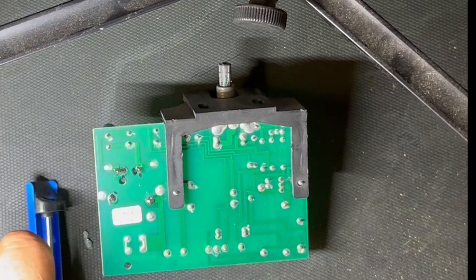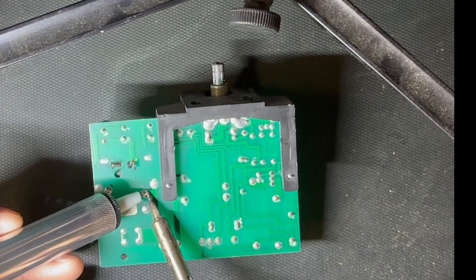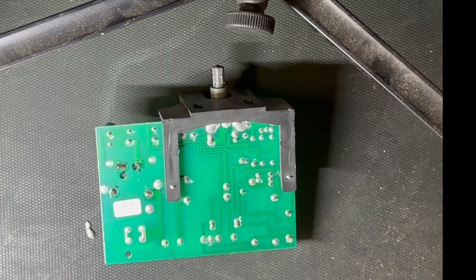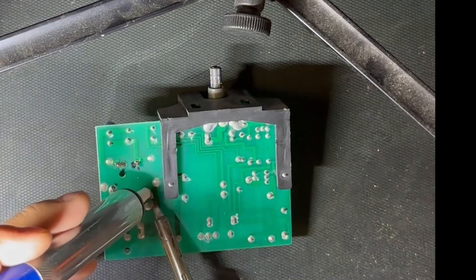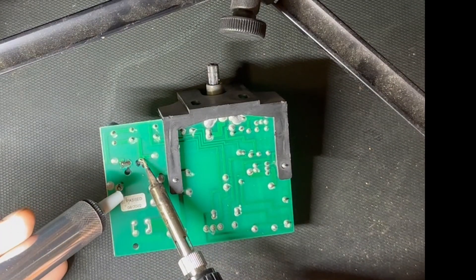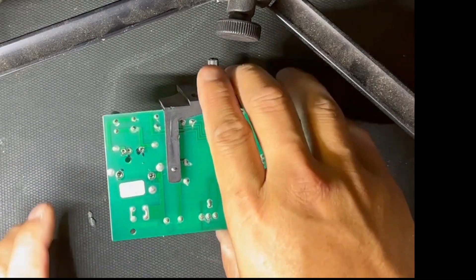I have the piece here. To remove the old relay I'm going to use the solder vacuum and soldering iron — just going to melt the solder real quick and pop it off.